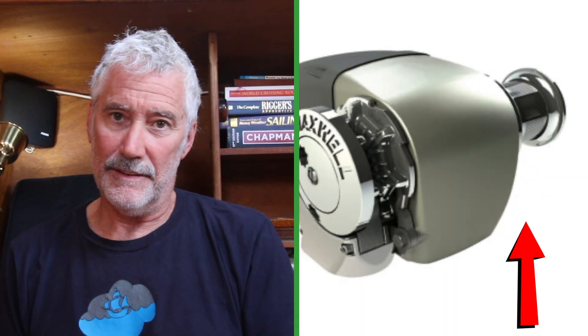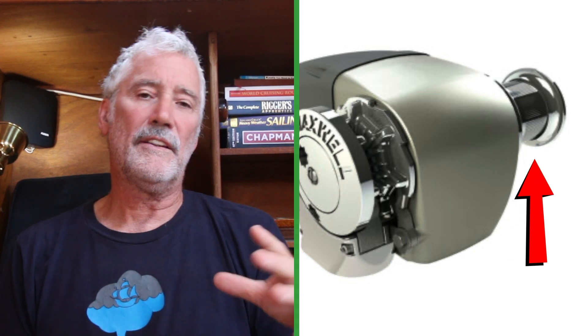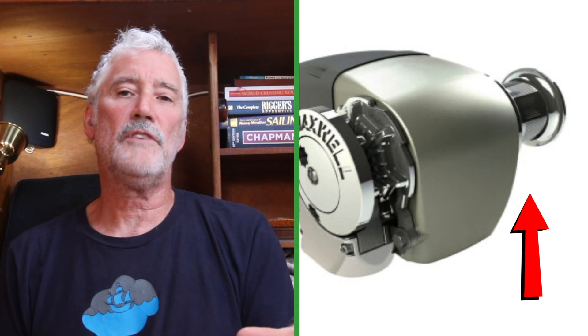There's very little chance of being caught with no juice to weigh anchor with this system of powering your windlass from your house batteries. And to take it a step further, if your windlass doesn't have a manual backup — well, it's not a good scenario. One last thing: I also like having a windlass with a capstan. It's another failsafe option for cranking down on or retrieving a line.